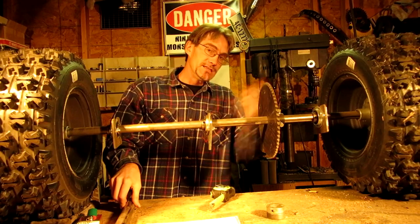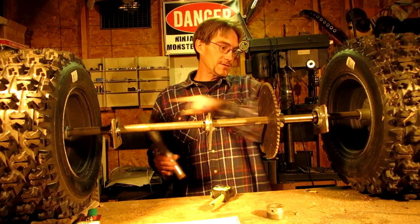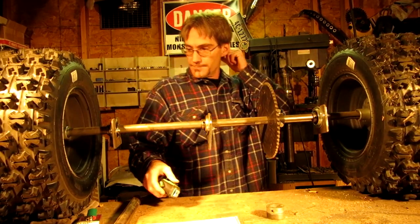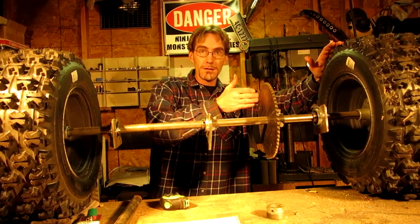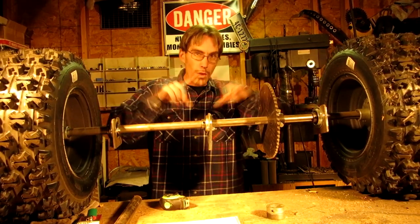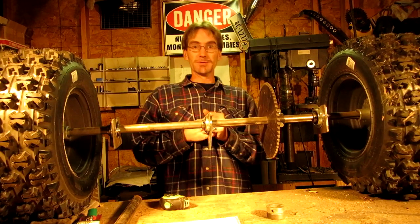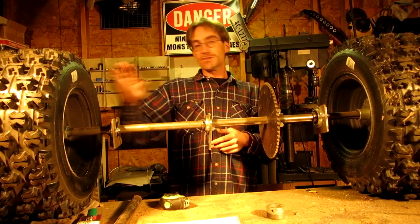The spacers actually help out a lot. You can even paint them a certain color — red, white, and blue, all bright orange, whatever — like I did on Ali's go-kart. The good thing about having a live axle is you deliver power to both wheels and deliver braking to both wheels. The problem with a live axle is that the wider the axle you get, the harder it is to turn. You'd have to add more weight to the front end to turn better. I've gotten that question a lot — people saying when they go to turn, the wheels are turning but they keep going straight. That means you don't have enough weight in front.